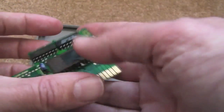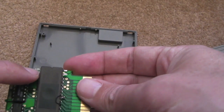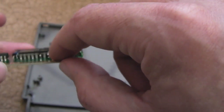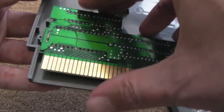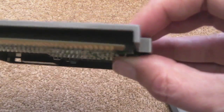Got the chip on there - it needs cleaning up, there's a nice blob of solder. So yeah, minimal wires. I could probably trim a few of these legs off - trim the top one, trim the second one, as they're not used for programming. I'm going to leave them on anyway just in case I need to reprogram this in future. You can see I joined the output enable to the chip select - or what I think is the chip select - and the power, the plus five, is rerouted as well. The upper address line comes from that second pin down to the pin where the output enable is lifted. This is not an elegant mod, but it will do the job.